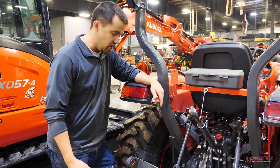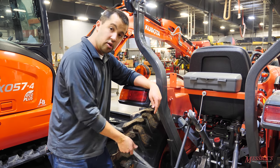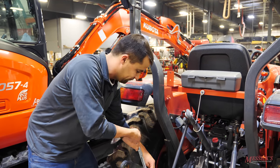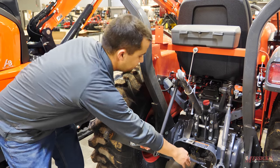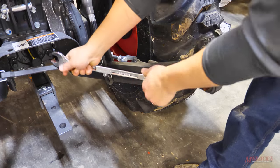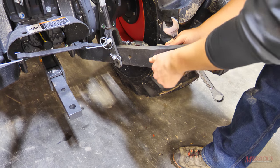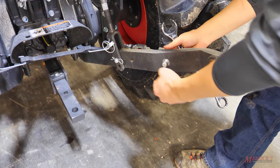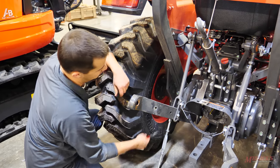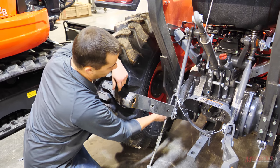The first thing I'm going to do is take off the existing check chains. It's going to be easiest to start by removing these bolts here in the back. If you do the other end first, it's going to allow this thing to spin around while you're loosening it. So if you take off the big nut while the check chain is still here, nothing's going to be able to spin around. I'm using a 24-millimeter open-ended wrench to do this. With the arm removed, you can see they dangle loose and it's easy to get back here to the cotter pin that's holding this clevis onto the back of the tractor. If we take that cotter pin out, we can now remove the clevis assembly.